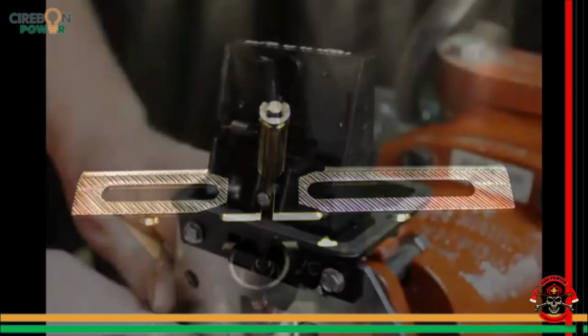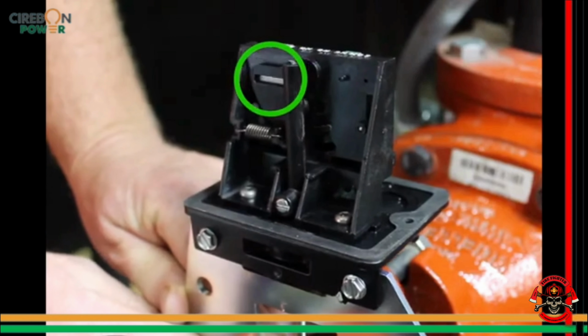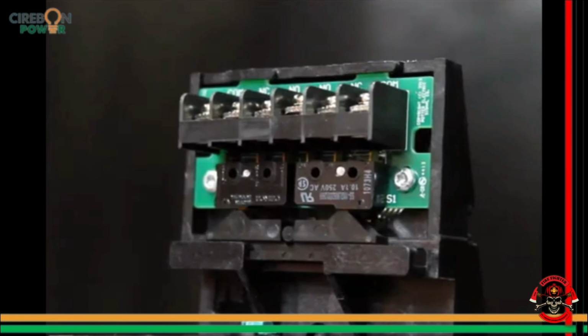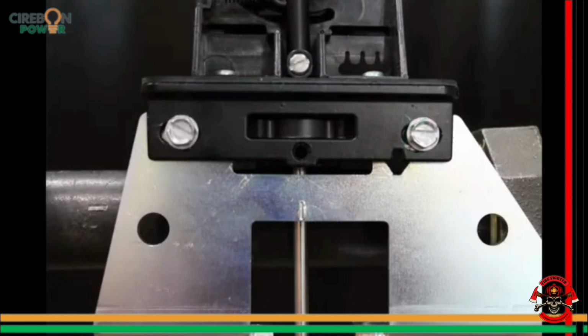When mounting the OSYSU in this position, it is usually best to use the white indicator visible through the window to aid in initially locating the OSYSU in the correct position on the valve yoke. If you have to install the OSYSU in the opposite position, use the other indicators, the switch activator, and/or the notch in the mounting bracket.